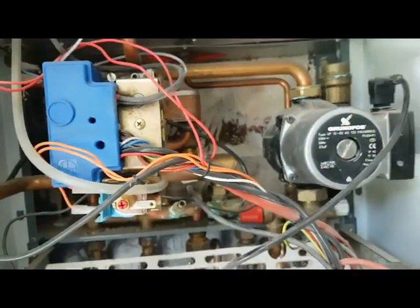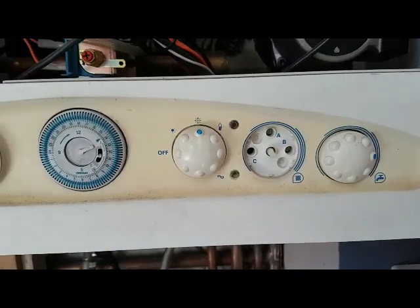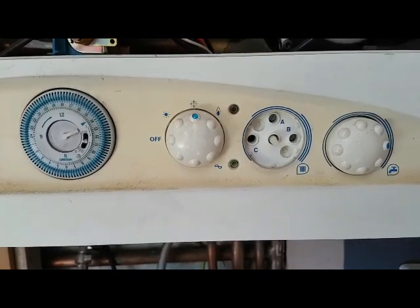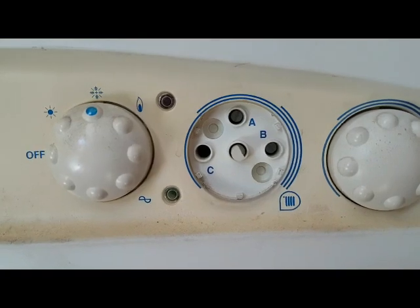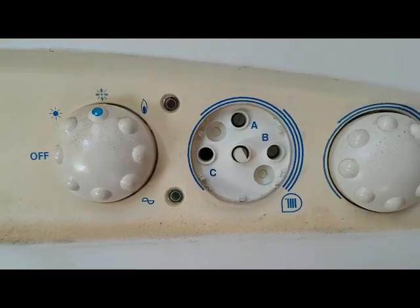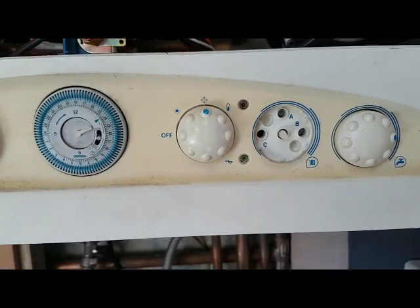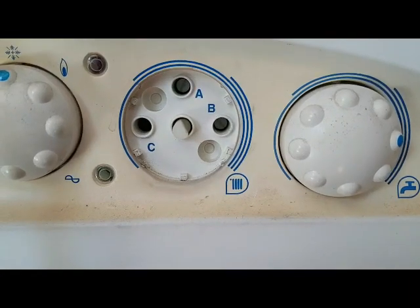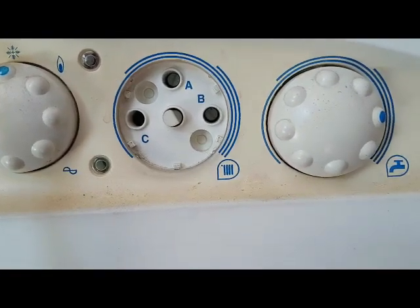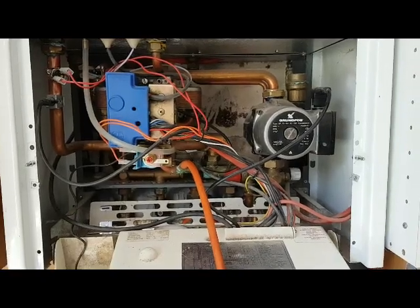On this particular boiler it's a range-rateable boiler. On older standard efficiency boilers like this you could range-rate it depending on the heating load. If you pull the central heat knob cover off you can see A and B — these are like potentiometers on the PCB and you can set the maximum output for the radiators. So adjustment A is to adjust your ignition burner pressure, and B is to adjust the central heating output. Those are your adjustments on this part for heating.